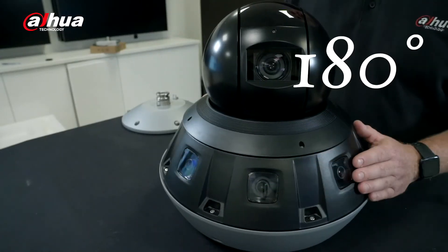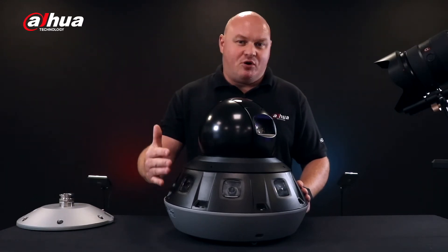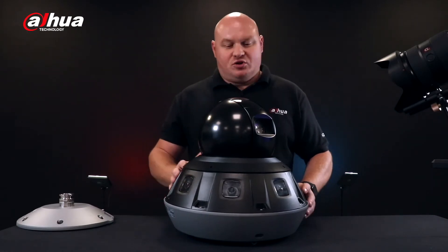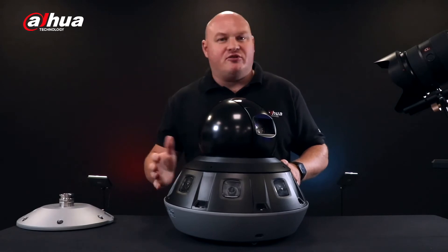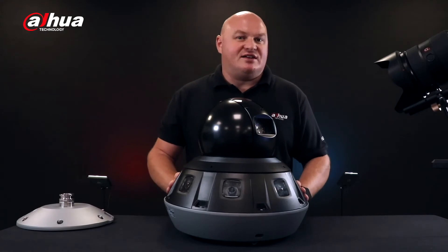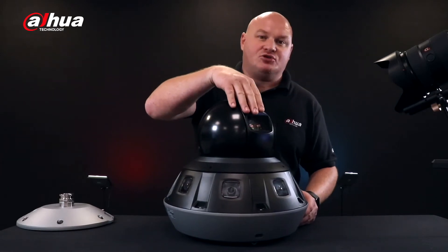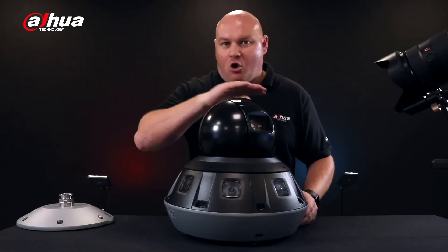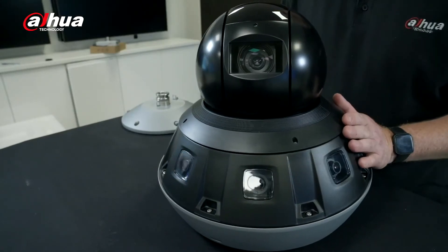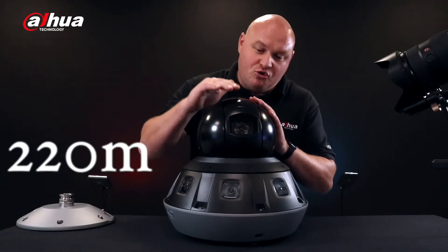The multi-sensor lenses around the edge come in different variations: 180 degrees, 270, and 360. The purpose of this is that if you put the camera on a wall mount bracket, there's no point having the wall within the field of view. So if you pick the 270 degree model, your 270 degree view doesn't include the wall where the bracket lives. All of the sensors, including the optical sensor for the super zoom, are starlight cameras — and the IR zoom range is either 220 meters or 400 meters.